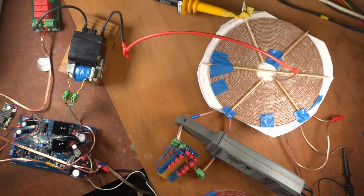The parallel resonant high current coil has a very high quality factor due to the low resistance. It is purely powered by the displacement currents of the high voltage coil capacitor. The high Q factor gives a high amplification factor to the current, but also a very narrow bandwidth of resonance. This means the parallel capacity must be perfectly tuned to the same resonant frequency of the series resonant high voltage coil.